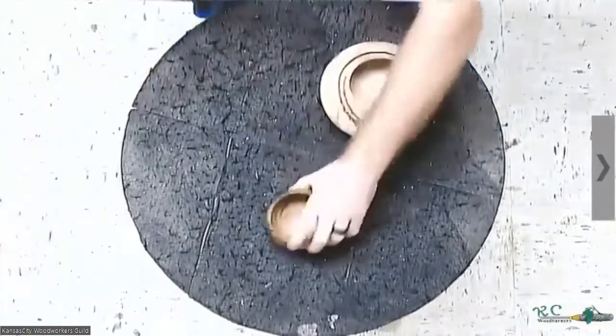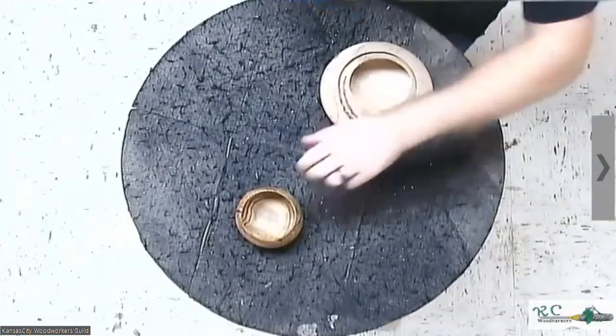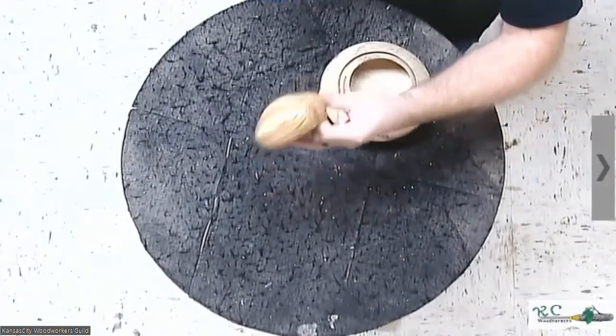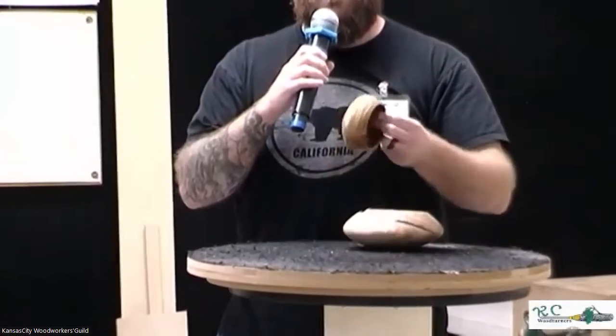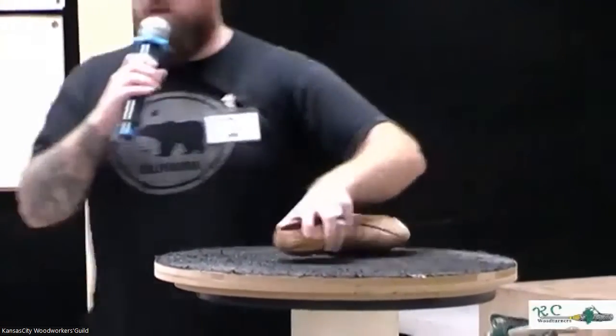This is a little idea of the piece that I made last month. I took the bottom off, freshened it out, and did a little sanding. I sanded it with 320, 400, and then burnished it with a nylon pad. This one has a little bit of tung oil finish on it, so it's nice.